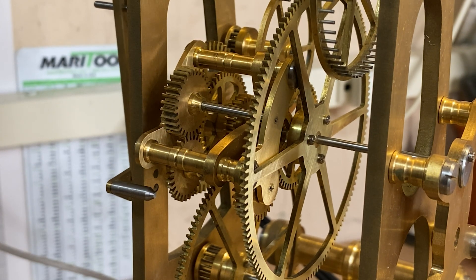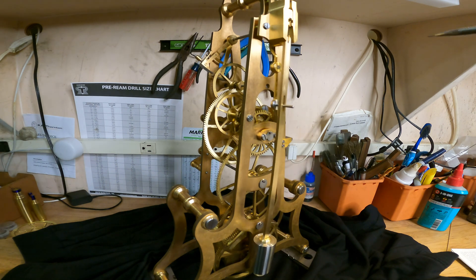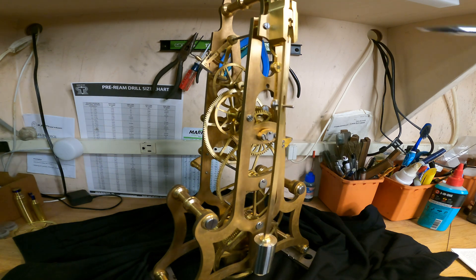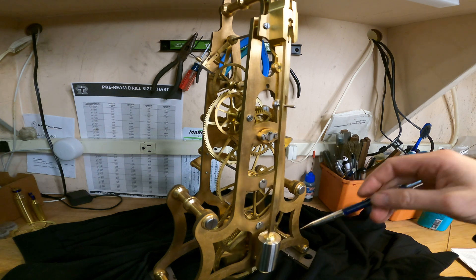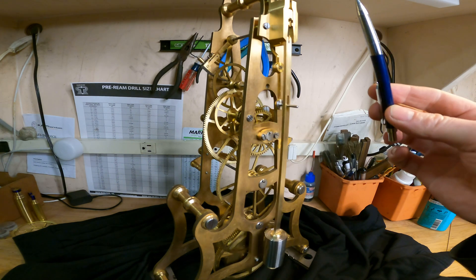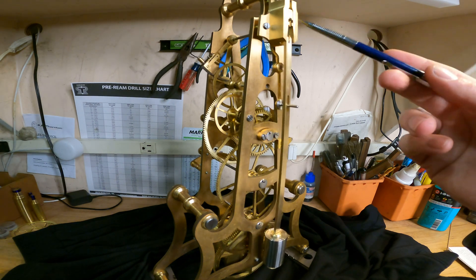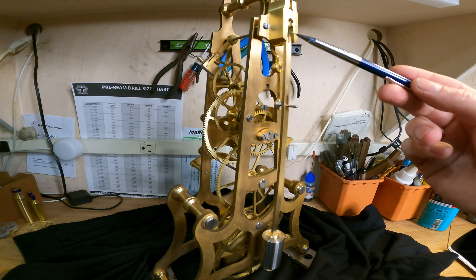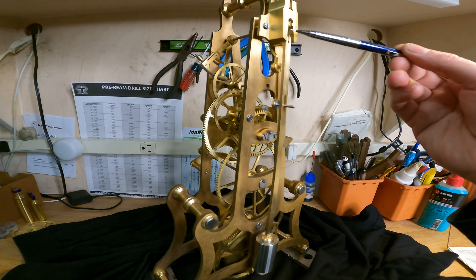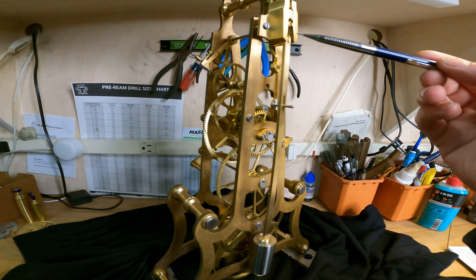Next I'll show you the details we did on the pendulum. Here's a rear view of the clock — it's a pretty nice view where you can see the escapement acting upon the escape wheel and the train going up from the great wheel. Looking at the pendulum, I made some pretty substantial modifications: changed the way it was hung, added a very substantial block to the back cock so it's a very solid attachment to the frames. I created a slot with an adjustment so this piece can ride up and down, giving a coarse adjustment of where the pivot center is for the pendulum.